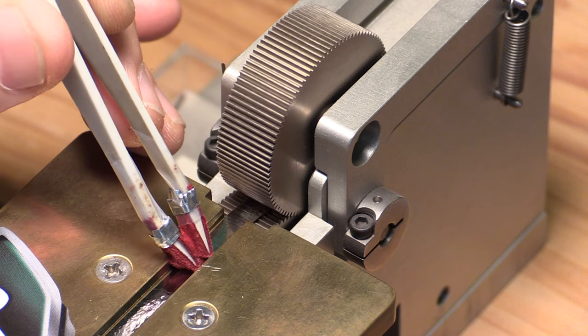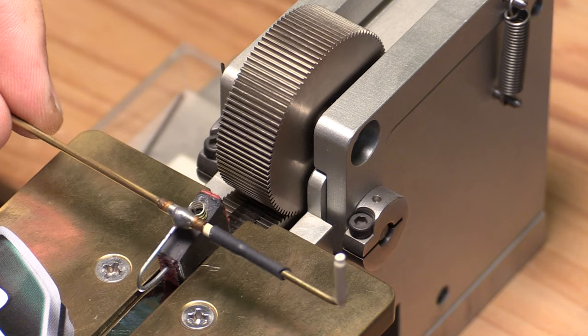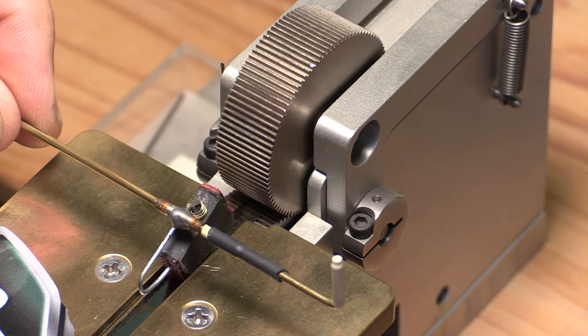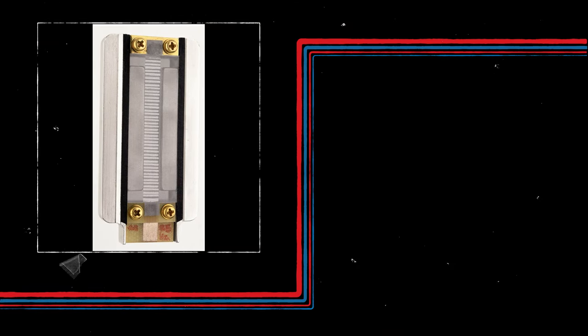It's incredibly delicate, far too delicate in this form to actually use inside the element of the microphone. So Royer runs this ribbon material through a custom-designed proprietary corrugation machine. That process not only corrugates or folds the ribbon, it also hardens it and makes it stronger. The ribbon is then installed into the capsule, as you can see here, and hand-tensioned by a very skillful craftsman to a very specific 40 hertz. It turns out that this tension is the sweet spot for the R-121 microphone design, and it gives you the best sound quality. The finished mic would actually feature a very fine screen over the front and the back of the capsule to protect the ribbon.